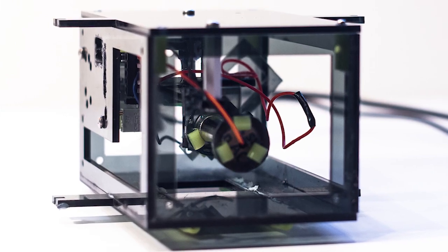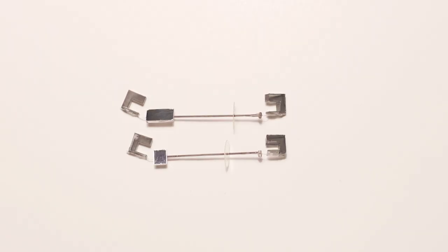In PP27, we found that the second mirror had to be longer than the first one. That gave us some problems as the second mirror weighs more than the first, and having two different parts you can mix up makes construction harder. With PP28, we made both mirrors the same size so it's easier to build and they both have the same properties.